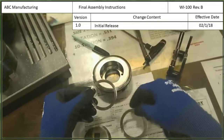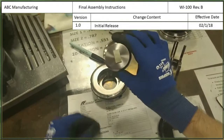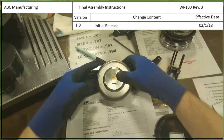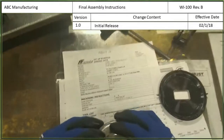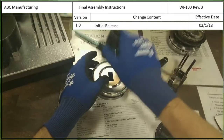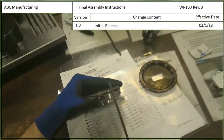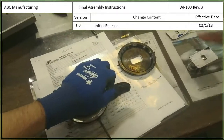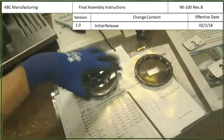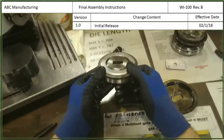With the die adapter we're going to insert the shims from the hook end. Then we need to line up the die to place it inside. We usually tap it like this just to make sure that it's in there all the way. Then we take our next Allen wrench to tighten the die so that it doesn't come out when punching. Now the die is ready to go.